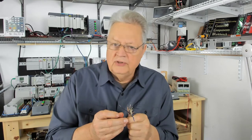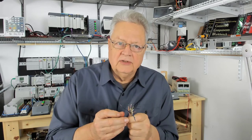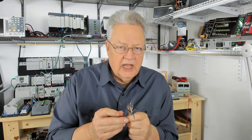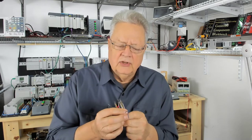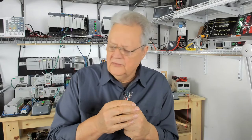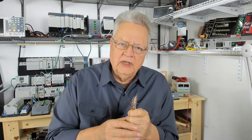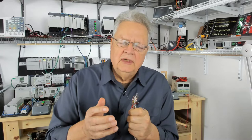Now, for the push buttons, those solder lugs can take a lot of heat, but on the toggle switches, they can't. So you want to make sure that you pre-tin all of the leads if they're not already tinned. The other thing that we're going to do is put a little dab of solder paste on each of the center lugs of the toggle switches, because remember